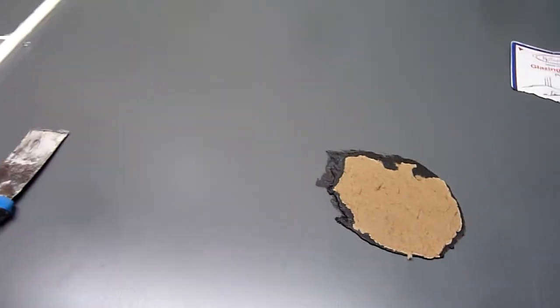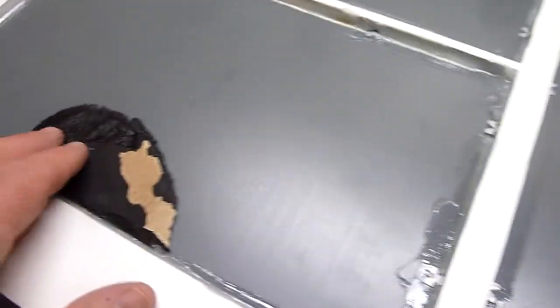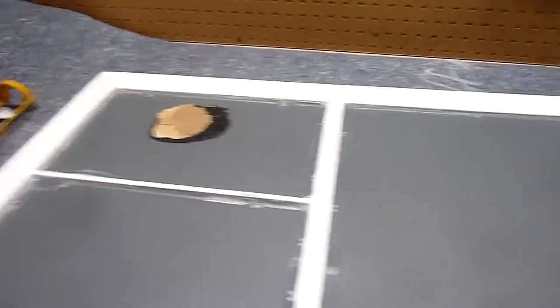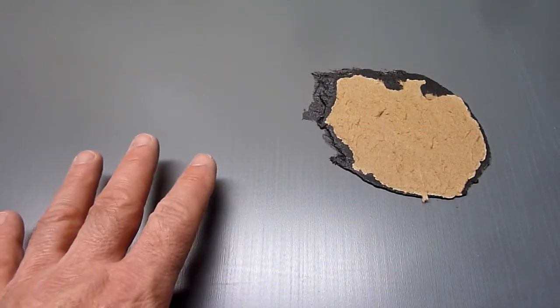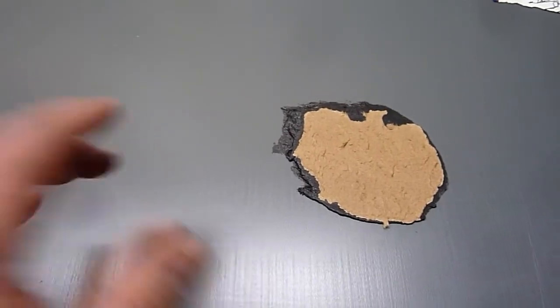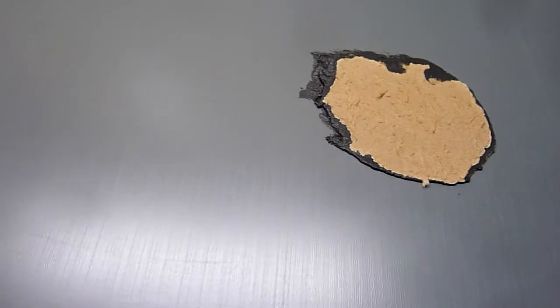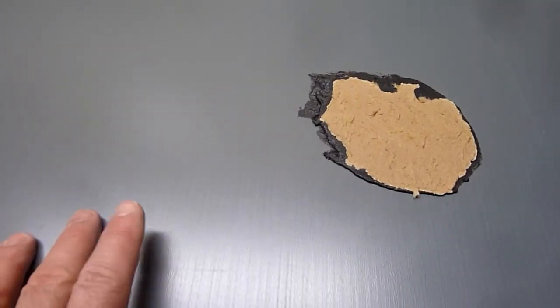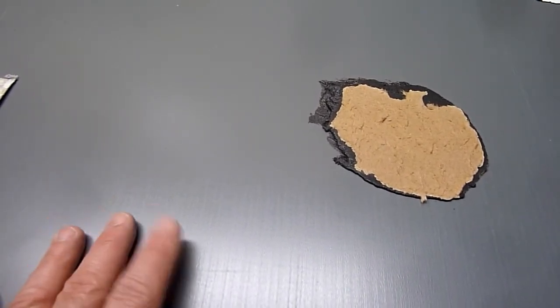This came from an old mirror that was on a bathroom wall. It was a single piece and I just took it to a glass shop and had it cut. That's why you see little spots of glue and even some drywall on here. I did not remove that because this gray surface is the actual back of the mirror surface, and any scratch on this is going to show light through — it essentially turns it into plain glass at that spot, so you lose your reflective capability. Be careful not to scratch it. It might even be a good idea to put some cardboard or poster board as a protective surface over this if there's any chance of it getting scratched from this side.